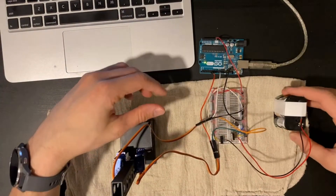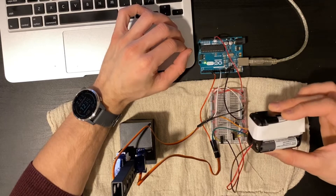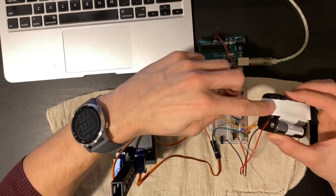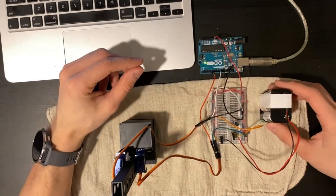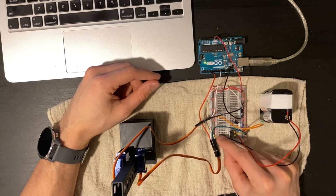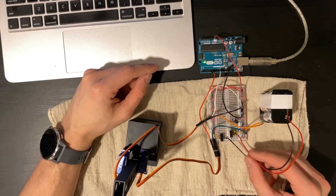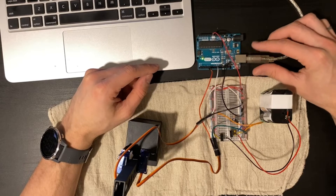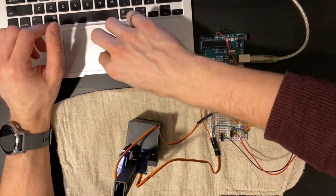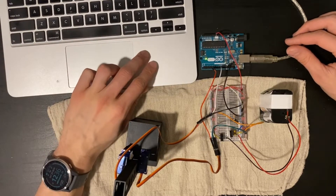The two servos are being controlled by an Arduino Uno and powered by six AA batteries in series to get nine volts. That's plugged into a breadboard where I have an LM7805 to get five volts out for the servos, plus a little micro switch so I can cut power from the battery pack to the servos. The Arduino Uno is connected to my laptop running the Python program, which listens using the microphone and sends a signal to the Arduino when it's time to dispense a treat. Then the Arduino controls the servos and actually dispenses the treat.